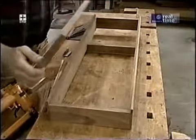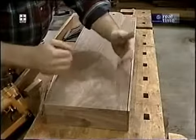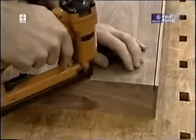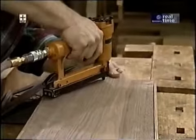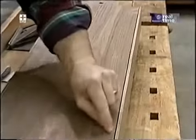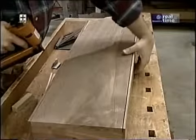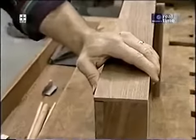Now we can install the back on the case. The back gets installed with nails only — don't use any glue, because this board is more than likely to shrink a little bit. I'll start by putting a nail right in the center of the bottom and one up at the center of the top. You might expect me to nail the rest of the back along the edge of the rabbet, but if I do that and the board shrinks it'll probably split right up the middle. So I'll tip it up on the side and nail through the sides — that way the board won't split.